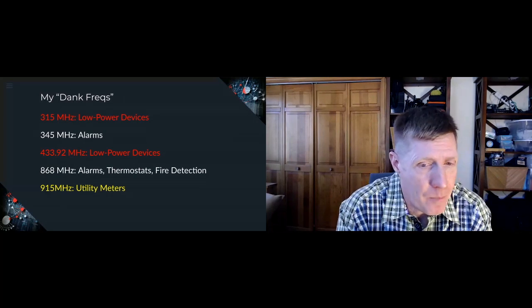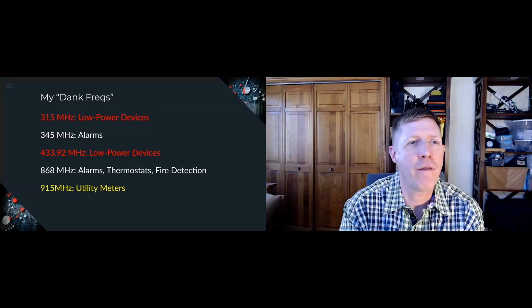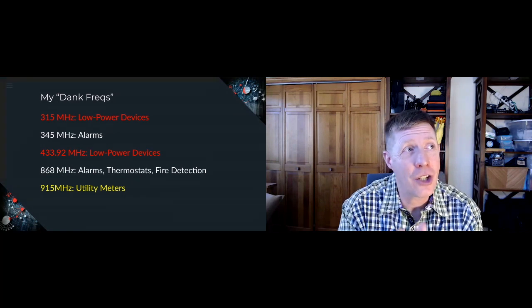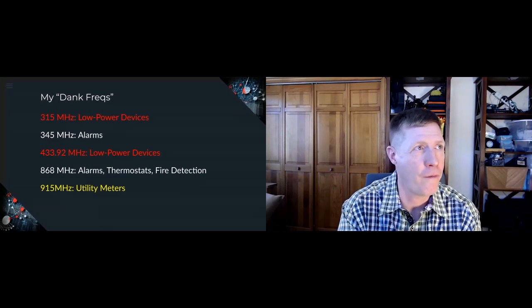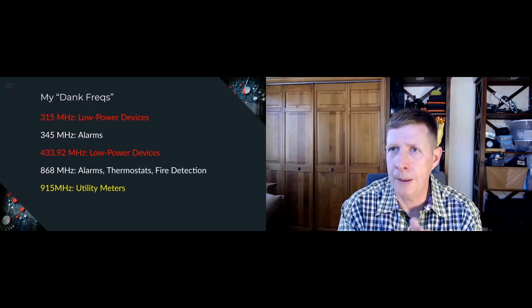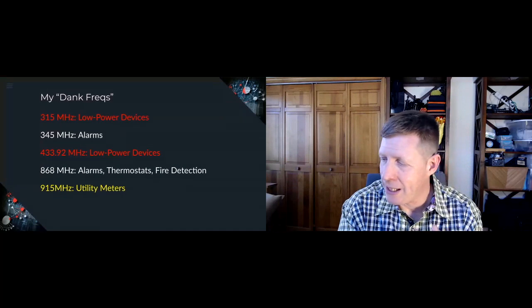But remember these, because if I have a gadget and I have no idea what frequency this gadget uses, I'm going to try 315 first, if it's an older gadget. If it's a newer gadget, I will try 433.92, or they call it LPD315 or LPD433. I'm going to tune to those frequencies and see if I can capture traffic off that device. There are better ways. We'll look at those better ways, but those are where you find your keys.